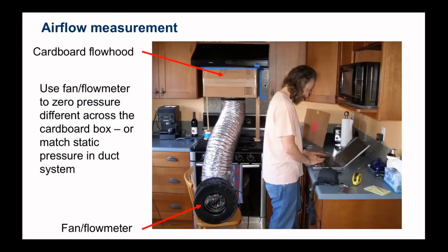If you want to measure airflow in somebody's kitchen — and by the way, this is my kitchen, and my colleague Woody helped do the measurements here — it's a bit tricky because different hoods have different air inlets on the bottom. You can see here we have a cardboard box cut up to make a capture device, and you need to do that for every hood. We're going to use a fan flow meter to measure the flow, and the reason there's a fan in that flow meter is because adding this ducting in the cardboard box restricts the flow.